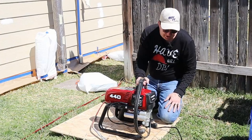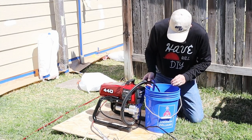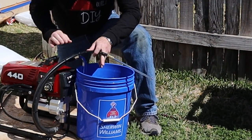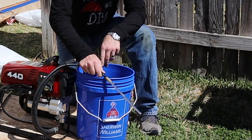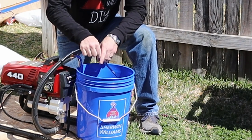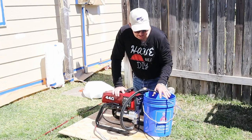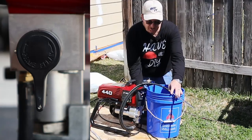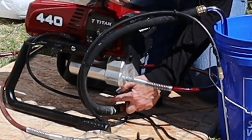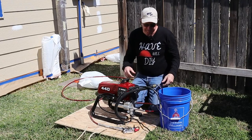I'm not going to hook the hose up yet because I've got another tip first. Get your bucket of water. When you go to start and prime, make sure you hold on to the tube so it doesn't sling up and get paint all over you. You can stick it in a waste bucket for priming, but personally when painting I leave it in so the paint goes back into the paint bucket. For first-time use — renting or new — put it on prime, which on this one is in the down position. Make sure the little ball valve is released and freed up before you start.